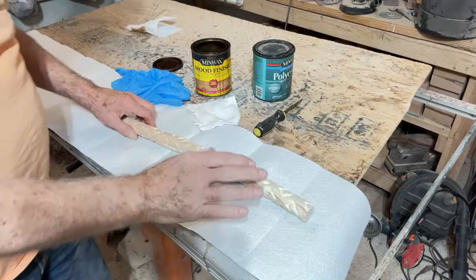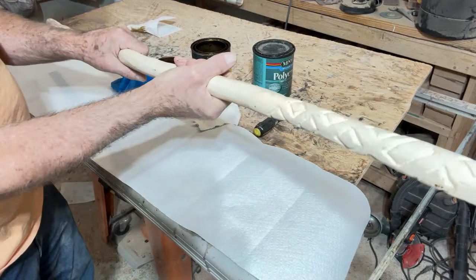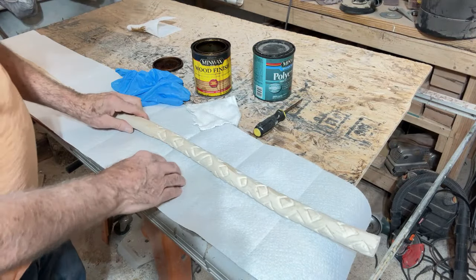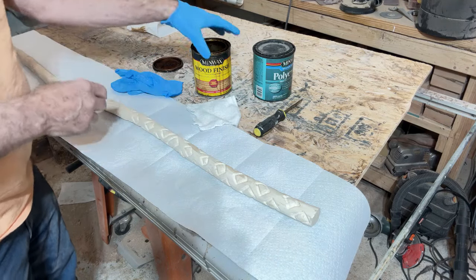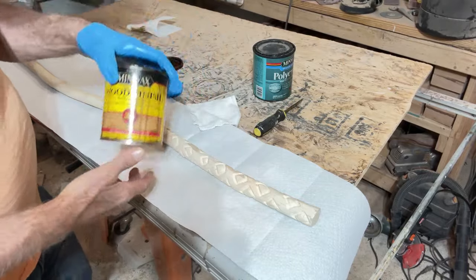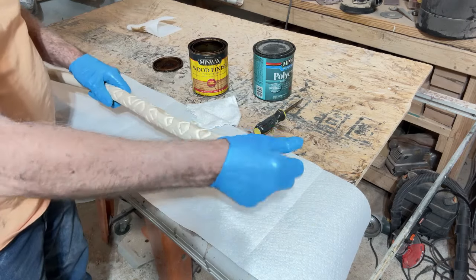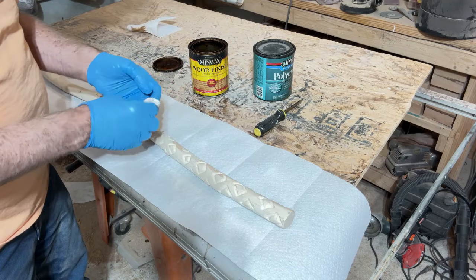Here we are on the table — we've got this all sanded and it feels really smooth all the way up and down. I don't know if an oak stain will cover up that spalting, but it has some nice spalting. I've got my rubber gloves ready and I'm getting ready to put — you guessed it — Golden Oak Minwax. That's all I use for the biggest part of my sticks. If I have a special order for a black one I'll do that, but if I'm just making them to put up for sale, you can't beat that oak stain in my opinion. With rubber gloves on, I just stick my finger down in there and start wiping, going right on down the stick.